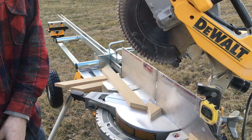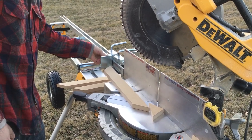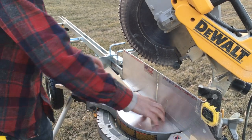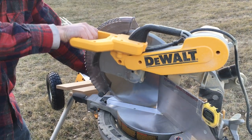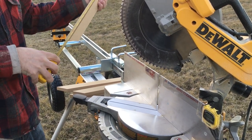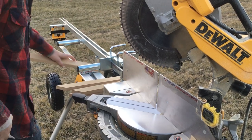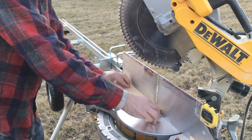A light 30th over 18 — so he's not going to go three flats; that would be an exact 30th. He'll probably go two and a half flats. Right there on 18. So you can see the speed at which he's able to get these cuts.